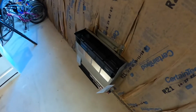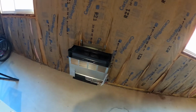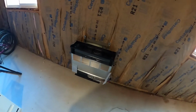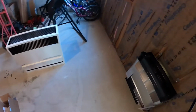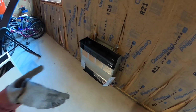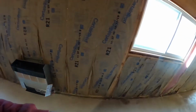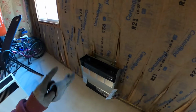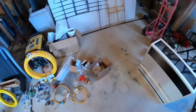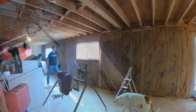They're pretty simple. You just cut like a 9-inch hole in the wall, mount this thing to the wall right in between the two studs, and put a cap on the outside and seal it up. So I already mounted those. I didn't get a video on those, sorry, but I just drilled a centering pilot hole through the wall, what they recommended off the ground and away from the windows, and then I cut it out with my Sawzall, I believe. So I do have to take that back off to put a piece of drywall behind.